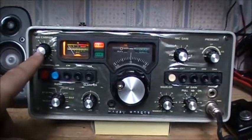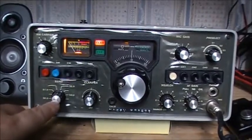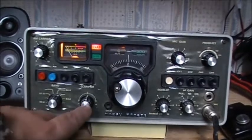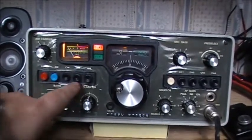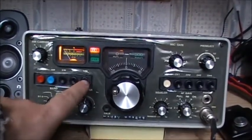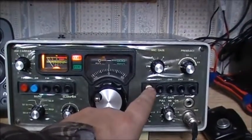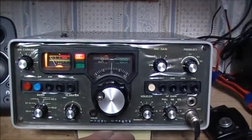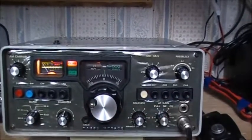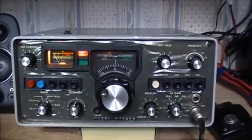So basically you have AM carrier — that's your power control. You have your band selection here; she goes from 50 to 54 MHz. You have your clarifier control and your mode selection, including power, AM, CW, upper and lower sideband. Over here you have VFO, and she also has provisions where you can put crystals inside for pre-selected channels — channels one, two, three, and four. She also has a mic gain control up here, and your pre-selector that tunes your receive as well as your transmitter.